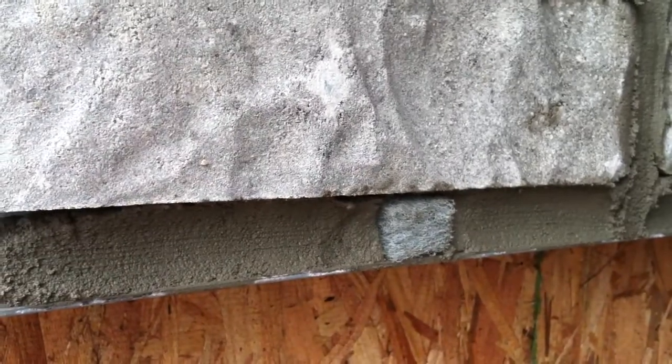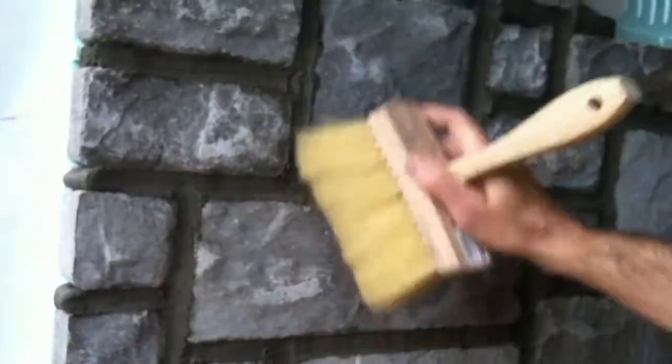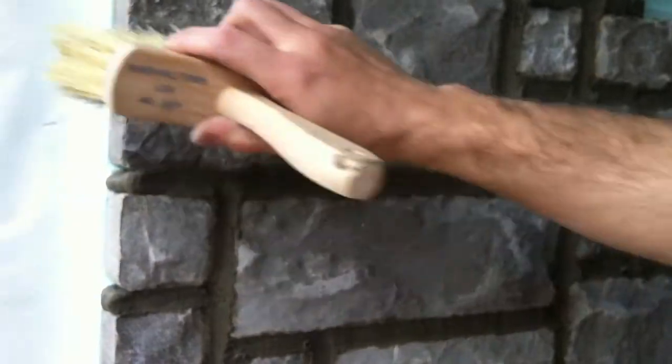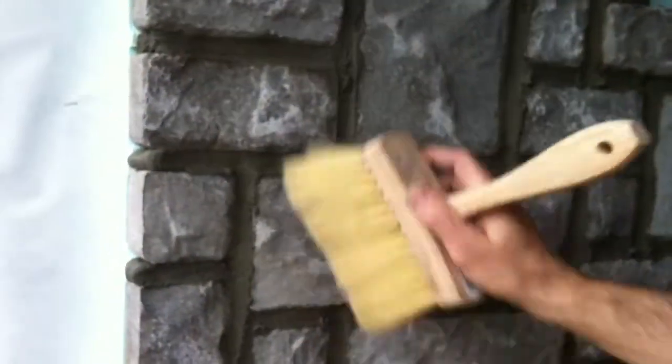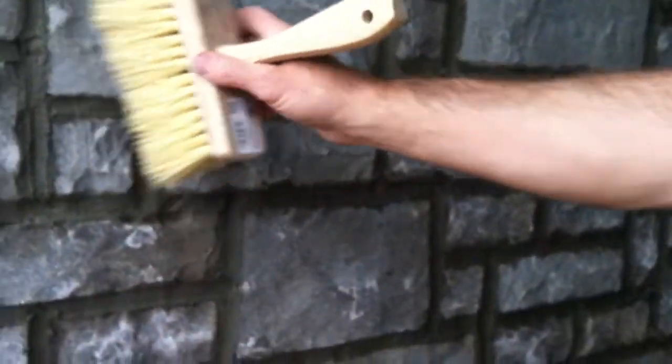That's what's going to allow it to breathe. And then you just take the brush. So I have these snots — I either get them with the back of the handle. Now this is a little bit wet because what's going to happen is it's going to come up on your brush. If it's really wet, I'll end up putting a nice light smear of cement paste on the surface of the stones. So you really want to wait until that's kind of crumbly.